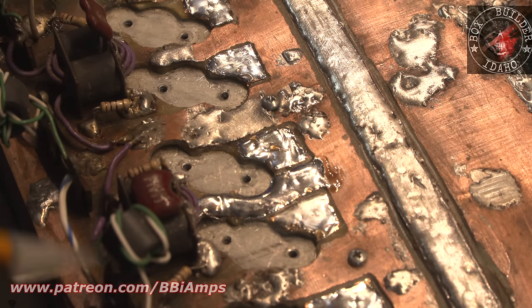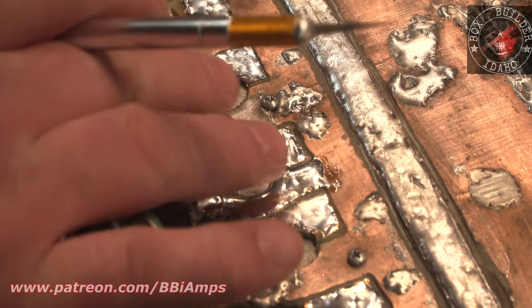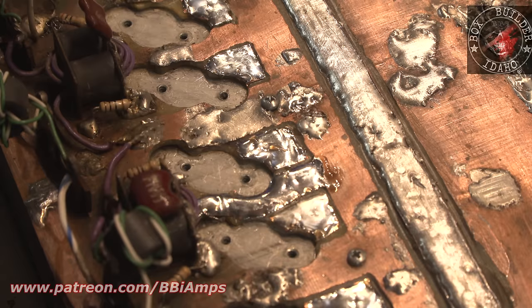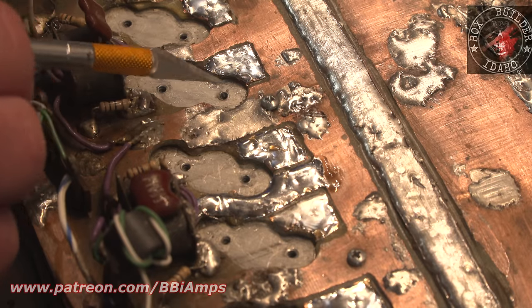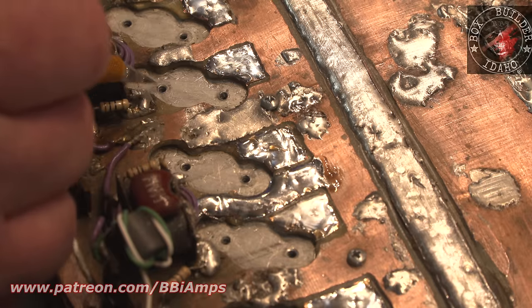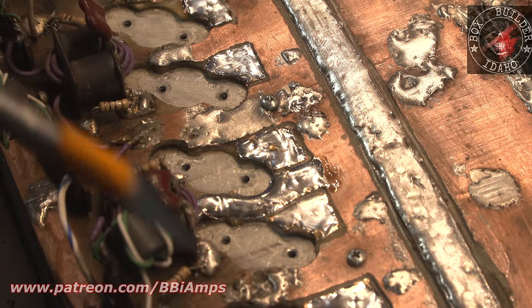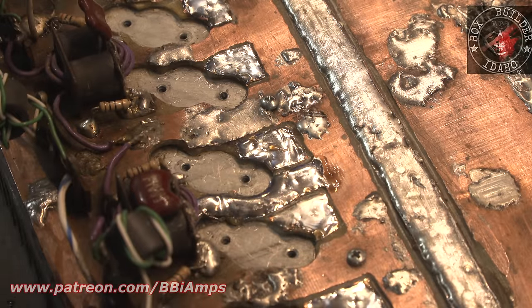If you are a new up-and-coming amp builder and you have one transistor that keeps failing continuously, like let's say you have one come in, it's got one burnt pill, you change that transistor out, and then a week from now it blows another transistor. Nine times out of ten, what that is, is where material has lipped up. You see this? See these big burrs? Over here too, usually comes from screws, and they'll fold the heat sink up, bend it up, and so it won't let the transistor sit flat on the heat sink, so it gets very, very, very hot.